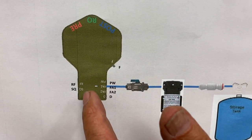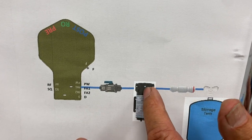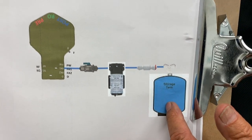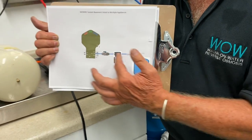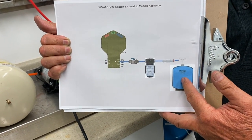Under normal operation the water is pushing, and the pump is also drawing water and forcing it into a captive air tank. This is pumping the tank pressure up to a good 60 to 100 pounds.